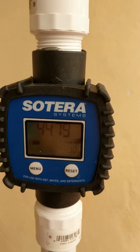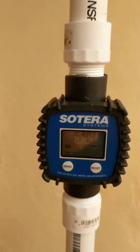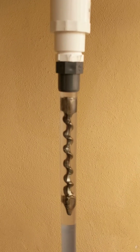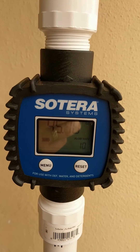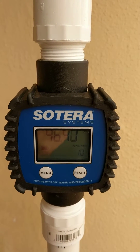So coming off of the pump, as you can see there, we've got 10 gallons per minute. What we're demonstrating is that we're able to run 10 gallons per minute through the half-inch unit. Now, I understand there's a whole lot of other plumbing factors in play in a normal situation, but here we've got 10 gallons per minute coming out on the other side as well.